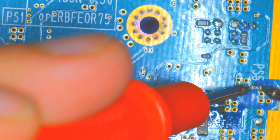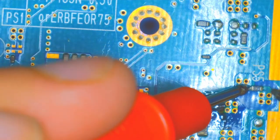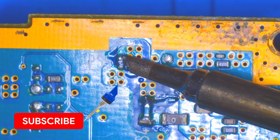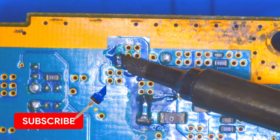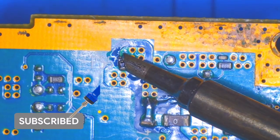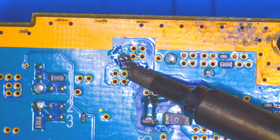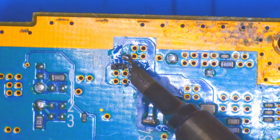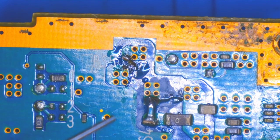This PS5 fuse is not good. I just need to remove the other fuse — PS5 in this case — and touch the soldering iron there to melt the solder and get it removed without destroying anything. We can clean that up with some IPA.